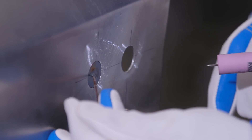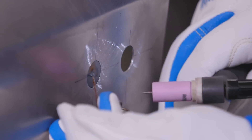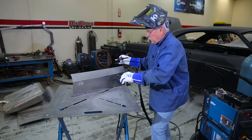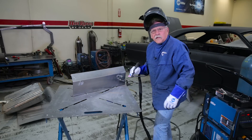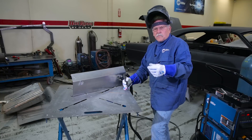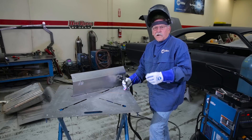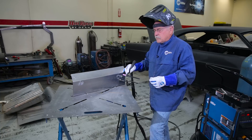You can keep away from the weld, you're not blocking your vision, and what we'll do then is find an edge that's fairly close to the other edge and just put a tack on it. At this point, you can break off your little piece of welding rod — we'll come back and grind that later — and then we can proceed to weld it. I'm going to use the pulse a little bit, and I'm using some Hobart ER70S2, which is a pretty standard TIG rod — a 40-thousandths rod. You don't need a lot of filler material, especially if you fit this properly.